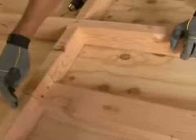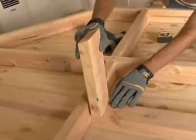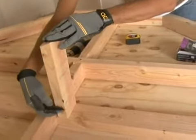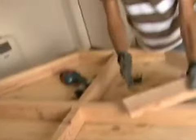If you notice, I have this small piece right here. The reasoning for this is after we get our two eight inch pieces installed, we have this gap here and it's just for more structure. Now the easiest way to get this is to set it in the gap, just get a scrap piece of wood, set it in the gap and go ahead and make a pencil mark right on the line right there for your height. Take it to your miter saw, cut it off, stick it in and go ahead and put at least two toenail screws in there. I like to add three, one on the other side.